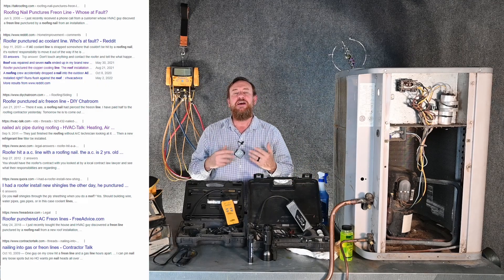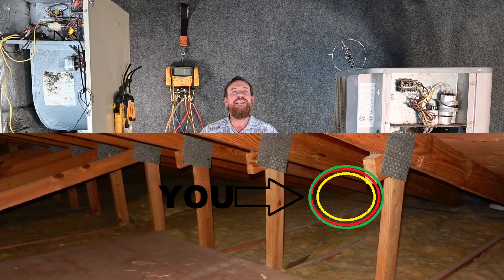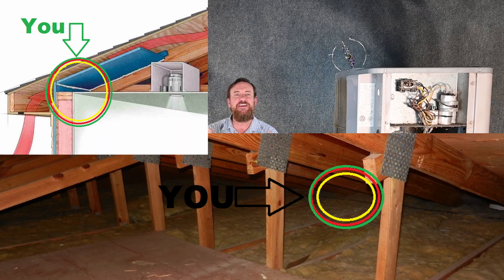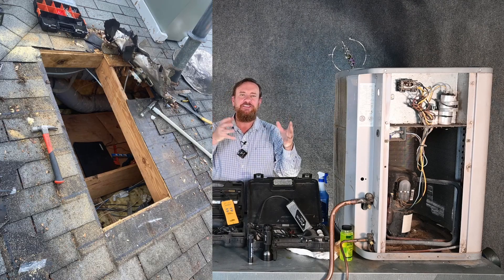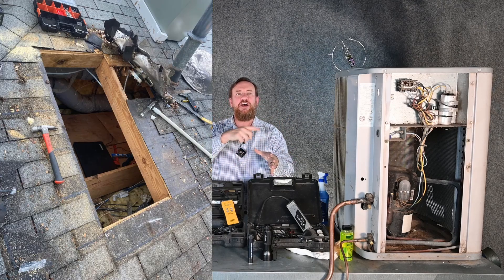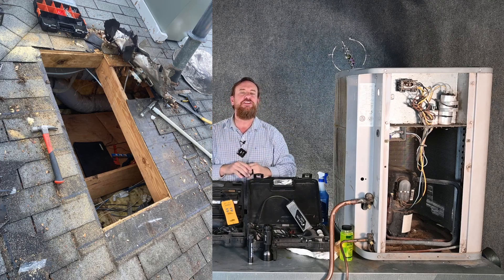Fixing a leak near the roof is very problematic. Think about crawling up into the tightest part of the attic with your torch out trying to fix the leak — you're surrounded by wood in a very tight area. It's very dangerous; you can have a fire that takes out the house. You need other people with you and fire extinguishers ready. What I prefer to do is have the roofer come back, take the roof section off where that leak is, cut a hole in the roof, fix it from the outside, and then they patch it back. That's the safer approach.